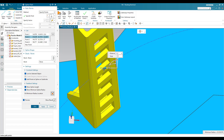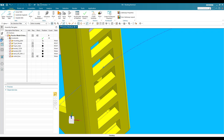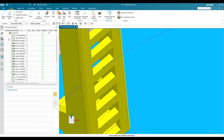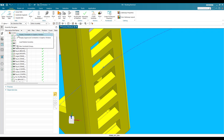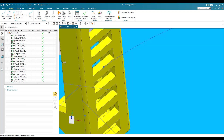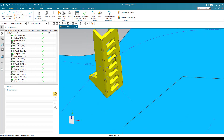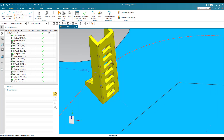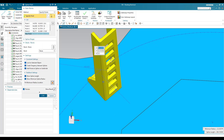If I try to move it, you can see it is not moving — it is associated with this particular model. To fix this, click OK, then go to Constraints. You can see there are a lot of constraints available. There will be a constraint at this point — right-click, select from list, and you can see the assembly constraint. Delete it. Right-click, select from list, and delete this one as well. Once deleted, there won't be any association with this spline path point.